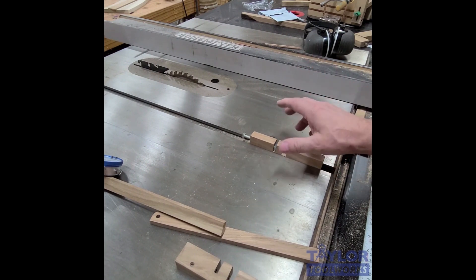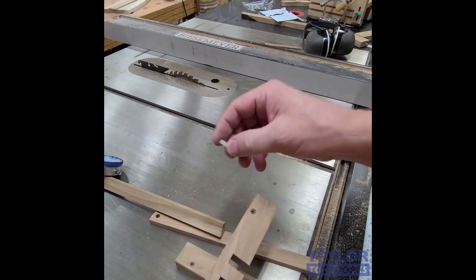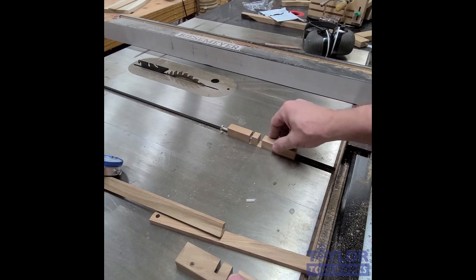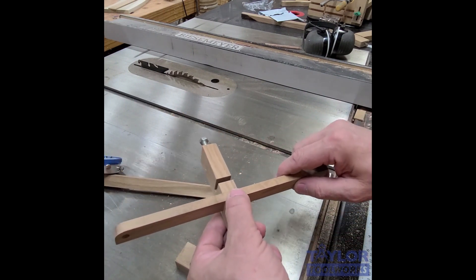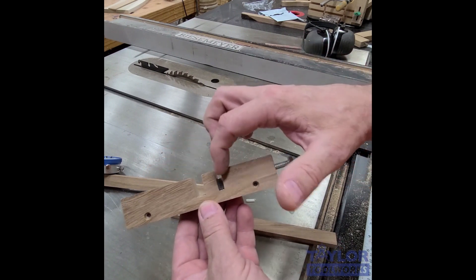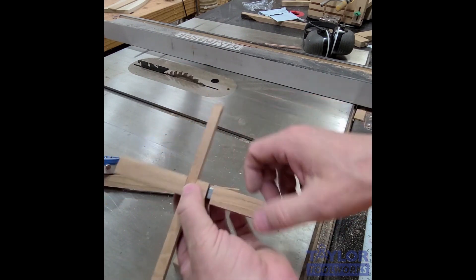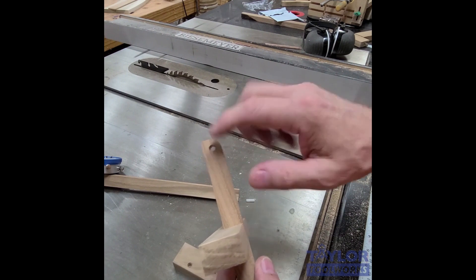You can try to cut a piece of wood to fit the slot exactly, but it'll always have a little wobble. Instead, I drill a couple of holes and use nylon screws — I tap the holes with a regular metal tap and insert the nylon screws so the bar fits very snugly and slides without play. I cut a slot in the bar for adjustability — in or out as needed. Then I cut a groove, drill a hole, and drop a square nut in the groove to provide threads, letting me tighten a regular bolt to lock everything down firmly.